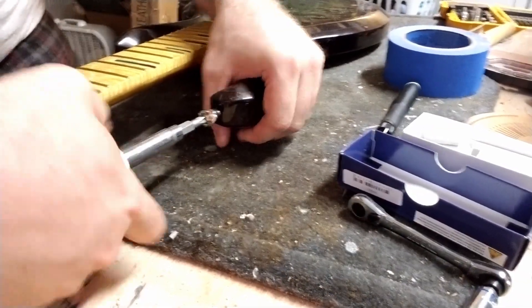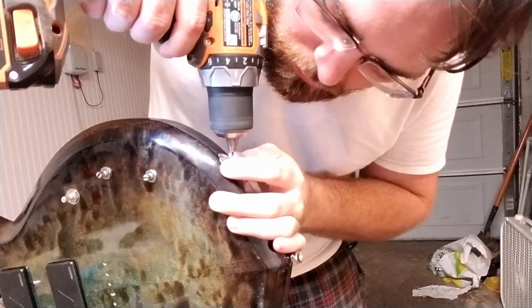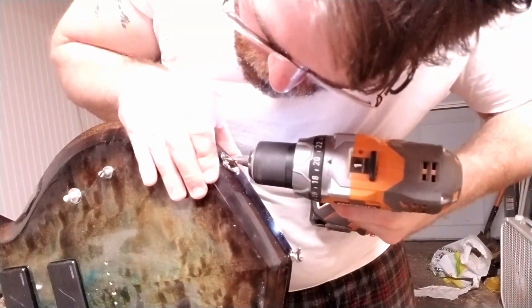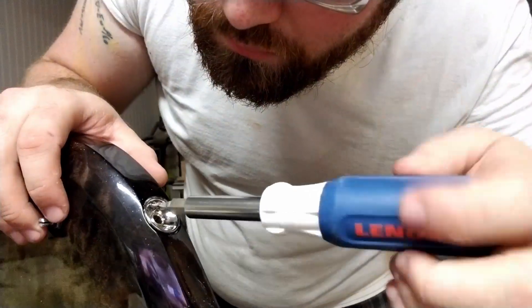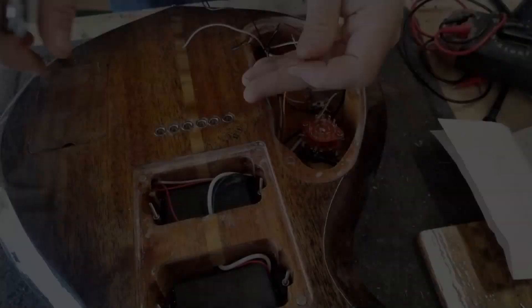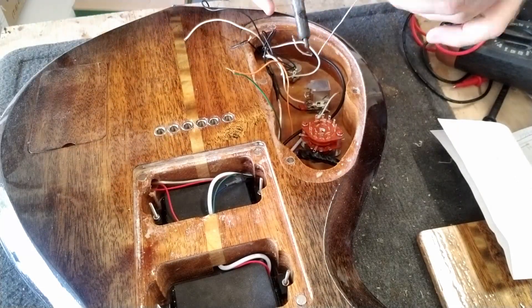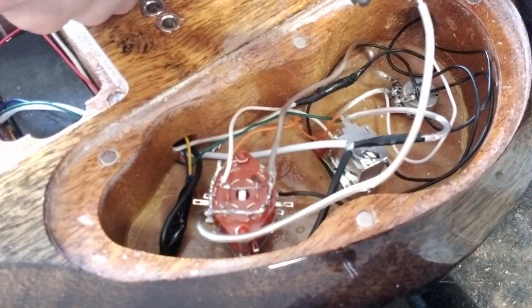I went with the elliptical strap mounts just to try and keep things from falling off — anything I can do to keep this guitar beautiful for as long as possible. Did a flush-mounted jack because I think those look gorgeous, which just barely fits with the little chamfer I've got on the edge. A few knobs — the tone knob in the middle is a push-pull which changes the voicing for the coils. Got a rotary five-way switch, which I've discovered wires up the same way as a super switch. I've also discovered that pretty much nobody but PRS uses them, so good luck finding wiring diagrams.